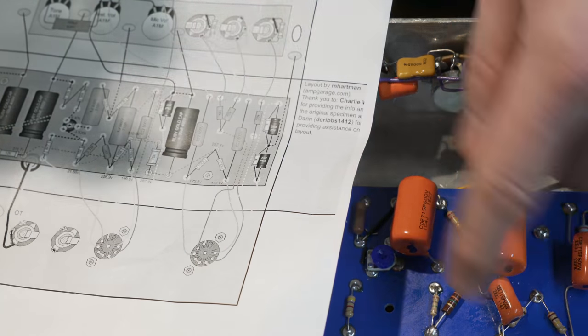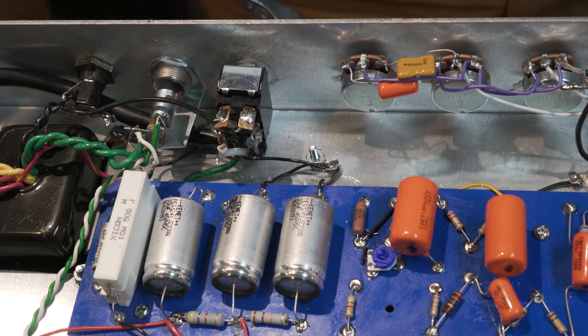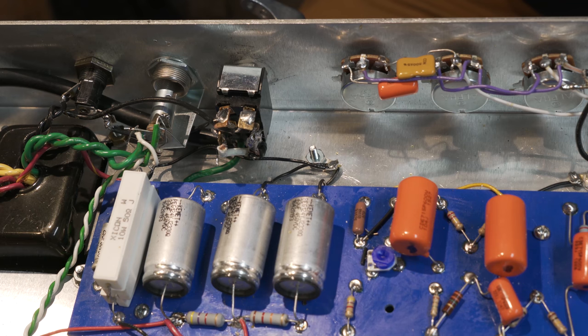Those things all exist. Those do what they're supposed to. So effectively, I will go through, and that's just that last check, and make sure everything looks hooked up correctly before I try my first power on. Now, when I do my first power on, I will leave the main tubes out and only hook up the rectifier so that I can see if my voltages look okay across the board. And if they do, then I'll be ready to plug in the rest of the tubes and give that a try. But we'll do that for you guys in my next video segment.